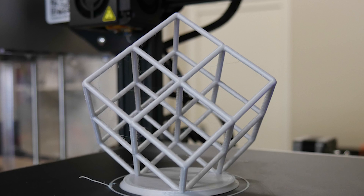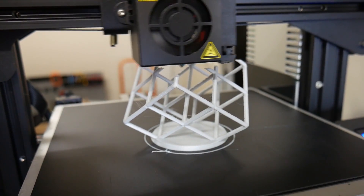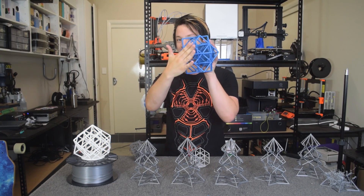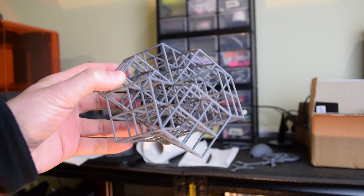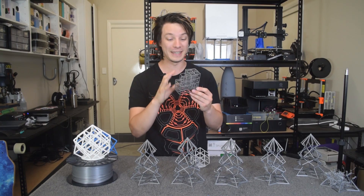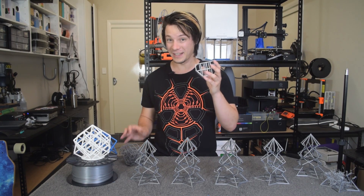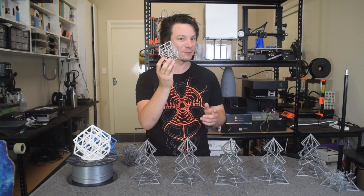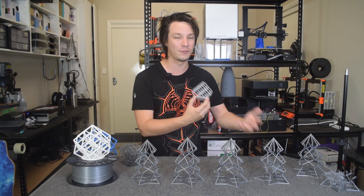Long-time subscribers to Maker's Muse will remember this. This was the original Lattice Cube I designed back in 2016, and it's designed to be really challenging for an FDM 3D printer to reproduce because it has so many points it has to move between — it's easy to knock it over. I made a version rotated around twice, then for Christmas that year I made the Snowflake Lattice. This one has a very tiny point and goes out. This version is gorgeous because it's printed on an SLA 3D printer — a Form 2 — which is the best ever version of this file I've printed. Obviously it's a different technology where it's easier, but on FDM, printing these things is pretty challenging. So last year I made the Christmas version, which is a Christmas tree-inspired lattice, and it's even harder because the overhangs in some areas are steeper, but then they branch into really nasty directional changes that tend to get caught up in the nozzle and break them over.